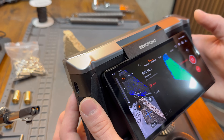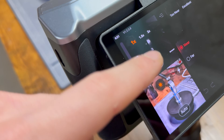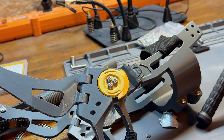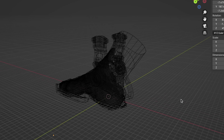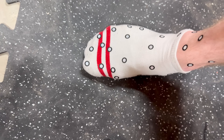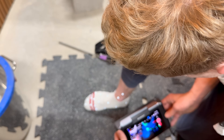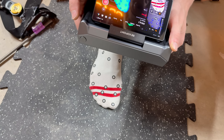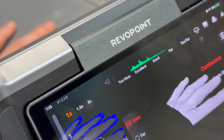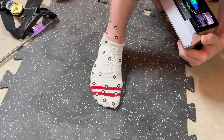This is an all-in-one scanner that can handle small to large parts with single-frame accuracy up to 0.04 millimeters to pull out fine details even at a distance, aided by its 2x infrared optical zoom rather than just digital zoom. For the ankle support system, I'm scanning my ankle at different joint positions as references for designing the hinges. I'm placing markers around my foot to cleanly identify placement for tracking, starting with my shin at 90 degrees. The far mode on the scanner works best for this, letting me keep a comfortable distance. Both near and far modes show real-time feedback if you're getting too close or too far, and it runs at 20 FPS so it can track as I move around.